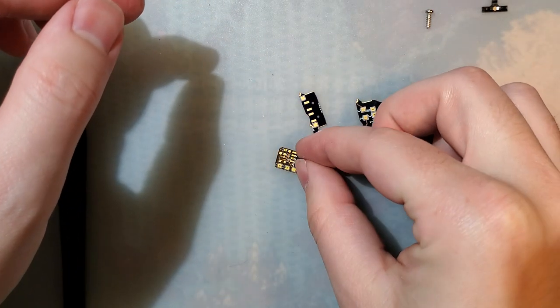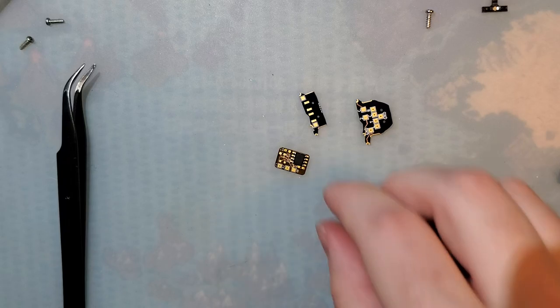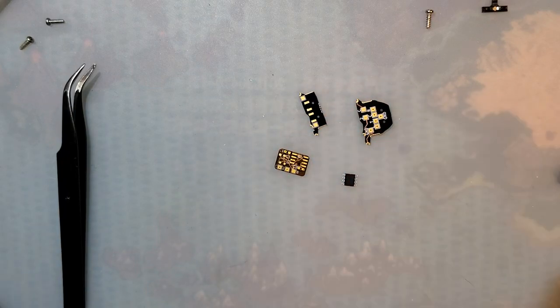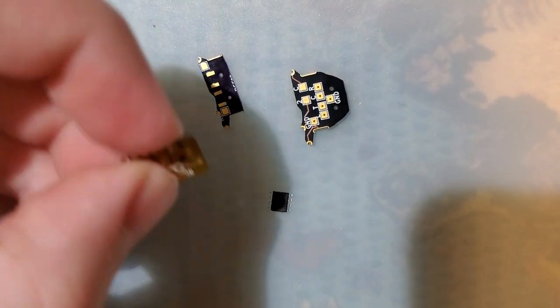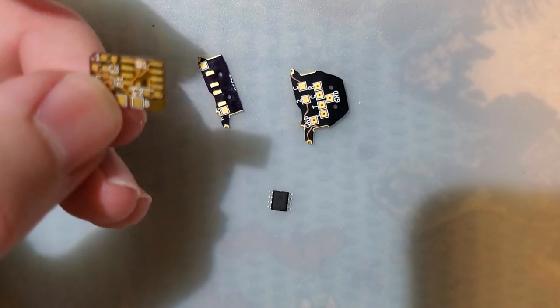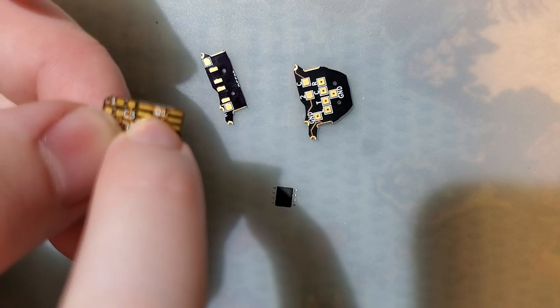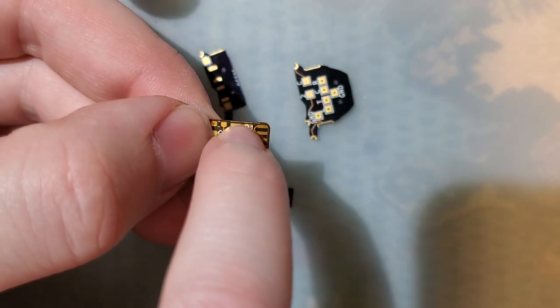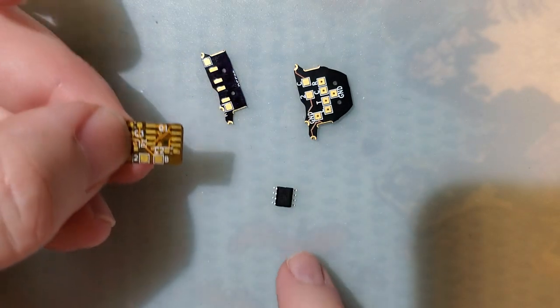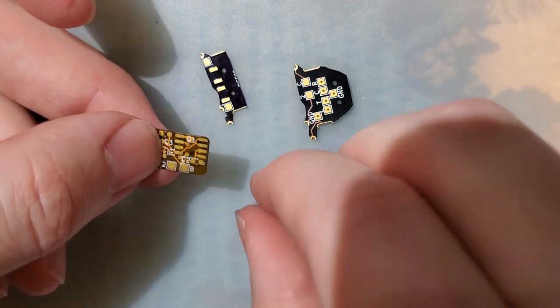And it is kind of a pain to assemble because of how small it is, but okay, we'll make it work. So one thing to note with these current boards that I'm going to go ahead and fix after this video is the orientation mark did end up getting cut off. You could see barely this little line on the silkscreen. That is the orientation mark for this IC.